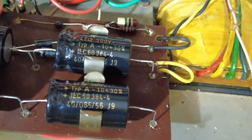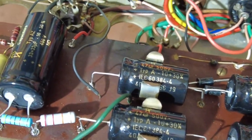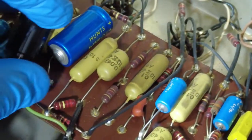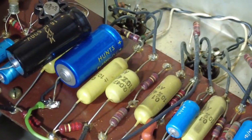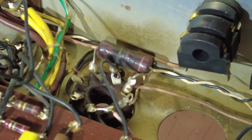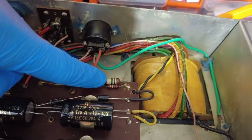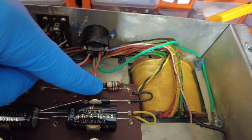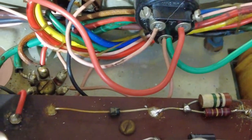I like to try and crown these eyelets if I can to make them look nice. I've got a 16 microfarad cap over there to change, and then we've got the screen resistors to change — there's that burnt one, he's toast. Then we're going to look at the bias section — there's a 1 meg resistor in there, which is just wrong. I think it should be 180k — I'll check the schematic. While we're at it, we'll put a new diode in there too.